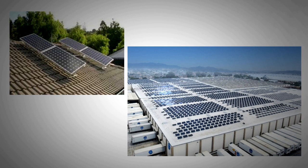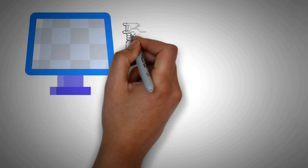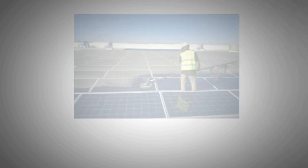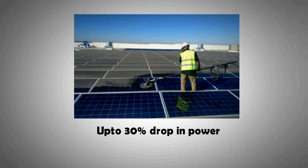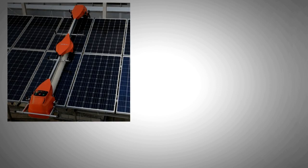Having covered progress in electrical and installation tech, let's look at cleaning of solar PV. It is common to find layers of dust or bird soiling accumulating on solar panels after installation. This is particularly true for regions with low annual precipitation — frequent rainfall can cleanse the panel, but in areas with little rainfall, dust and bird soiling can lead to up to a 30% drop in power. Given that we'd like to see PV panels as maintenance-free, some solutions have emerged. For larger areas there are robotic cleaners built on similar technology to automated lawn mowers and vacuum cleaners.